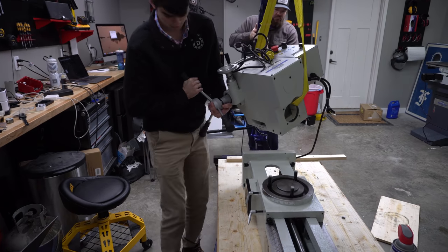We're gonna use 3 separate tools for the cutting process. Starting with a 3-inch facing mill to get the surface flat, followed by a 6.5 millimeter drill bit to create the 96 equally spaced holes. And finally, a chamfer tool to clean up the edges of the holes as well as the perimeter of the block. To get started, we need to find the bottom left corner of the stock material because I set that as the origin of the part in Fusion 360.